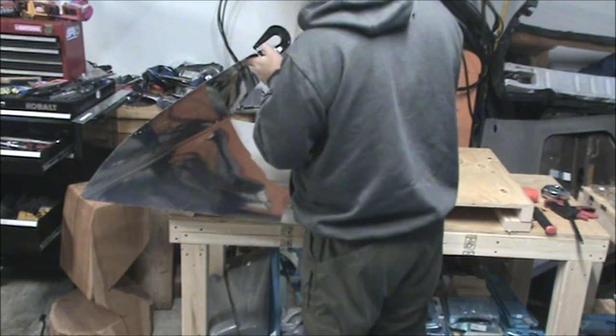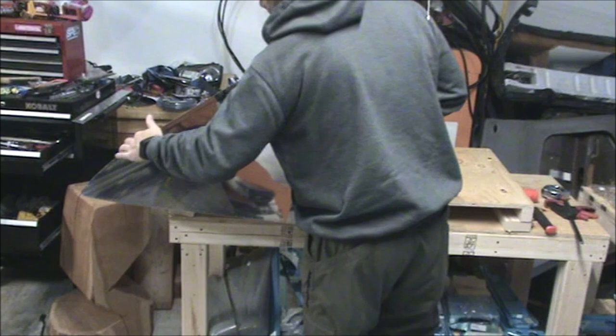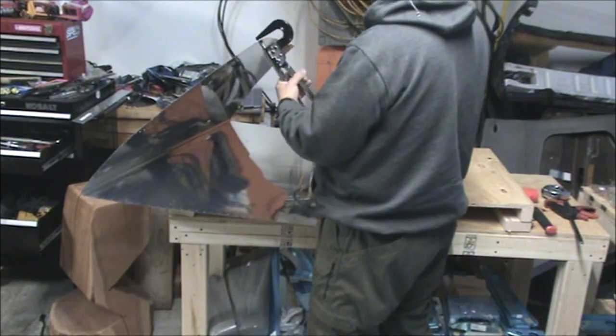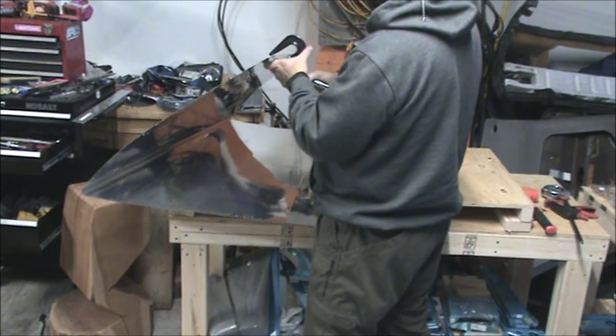And with the 3-inch yoke, you can go about 3 holes in, is about the deepest you'll be able to run with it. So you will need the C-frame dimpler, or a C-frame dimpler of some sort, right off the bat. Unless you plan on doing all these in here with a pop rivet dimpler, which I'll include a link below. I don't have one yet.